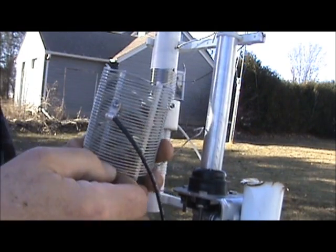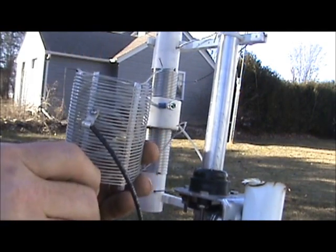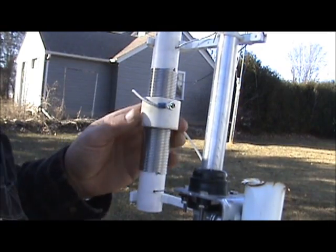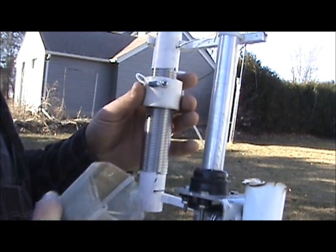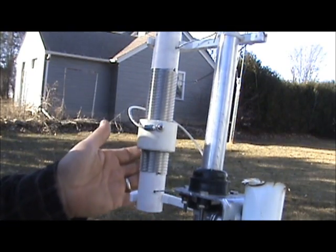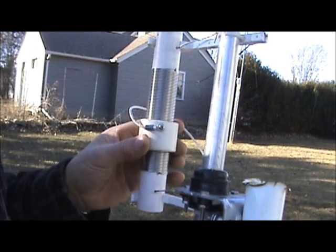get the clip, find the hot spot on the coil until you get a good load SWR or a good frequency response, and of course tighten the clip down and hope it hasn't moved on you. Our coil performs the same function, but no tools are required — simply slide the coupling up and down the coil until you get to your lowest SWR, and you can sit there and operate within minutes. No tools required. The coil will run at 600 watts of power without any problem and it's easy to change.